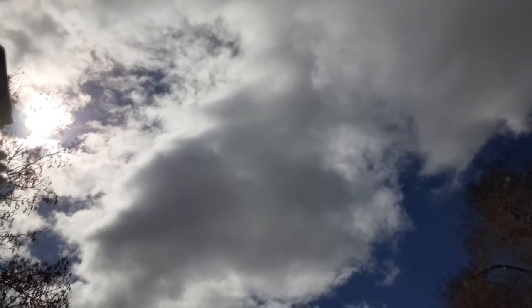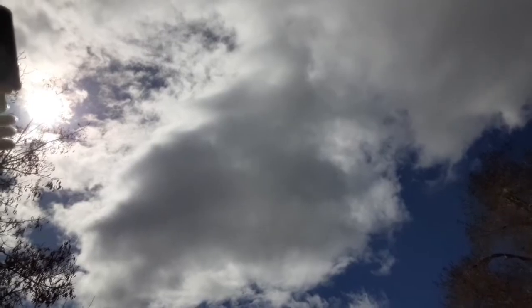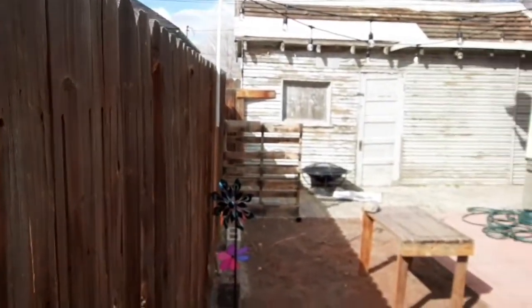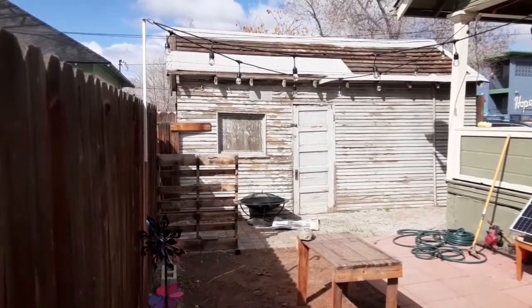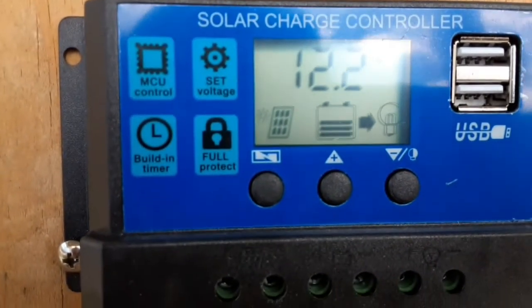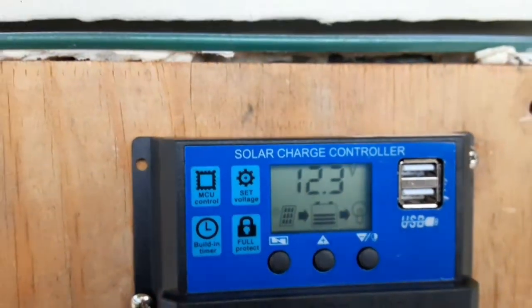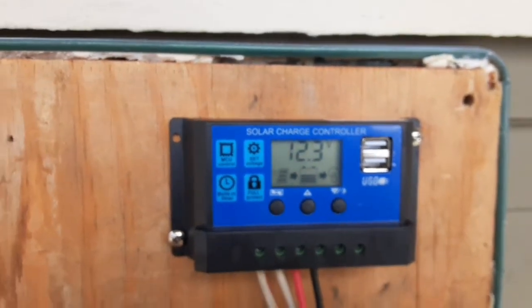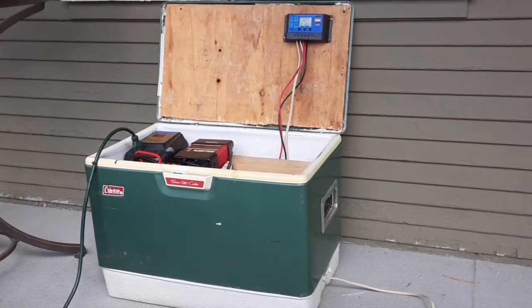As you can see, the sky is not working out for me today, but it is still charging the battery with minimal sunlight — we're probably getting about 20 watts in right now. I'm using a string of lights out in my yard to test out the storage capacity of the box and see how well it's charging. As you can see here on the solar controller, it's staying over 12 volts. You can see the solar panel is providing power to the battery. The battery is about halfway full right now — you can see it just went up to 12.3 there — so it seems to be charging up the battery and providing power for the string lights.